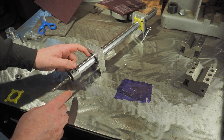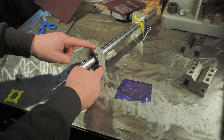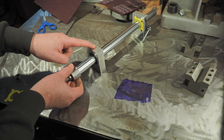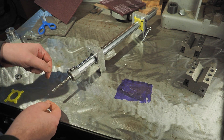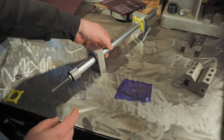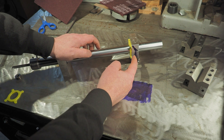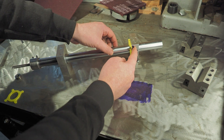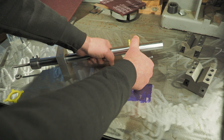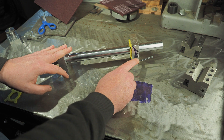What we have here is 25 by 38 millimeter very thin bearings and they're sitting in a couple blocks. I think this distance is 45 and a half millimeters. So this is going to give us a rotary motion here. The only thing that was a little bit challenging was in here there is a split cotter which is a brass shim that presses on to the shaft and when I tighten this down it locks the shaft from rotating. I actually don't use this that much in practice but for some things you need to have this here.